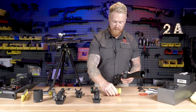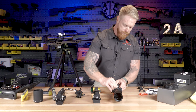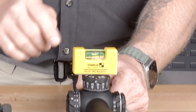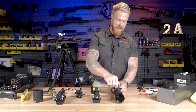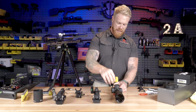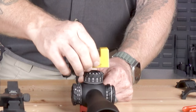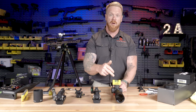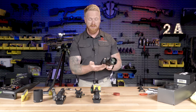Right here I have a machined piece of steel. I know it's flat. I get it to a spot that is level — this table is not perfectly level, but that's a pretty level spot right there. When I had this on zero, it doesn't matter, that's not quite zero but it's close enough. I can see that's not level, but I know that if a turret cap isn't level, it rotates and I can find a spot where it is level. I found that 11.43 was perfectly level on this, so I've confirmed that the turret housing bottom and that scope cap are parallel.